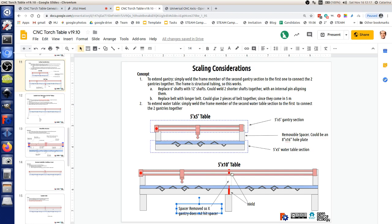Using the plain 1-inch solid cold-rolled steel rods upon which the universal axis glides — right now we're using brass bushings as the gliding surface, and in the future we might print nylon bushings with high-temperature printers. Those bushings currently cost about $2 each — perfectly fine for low-cost, medium-precision drive. But there's the sag detail to address: this will sag on you.